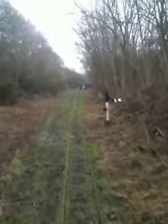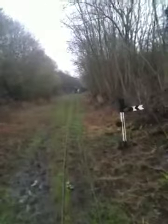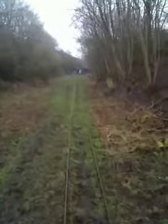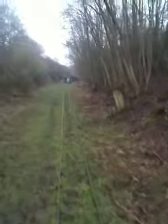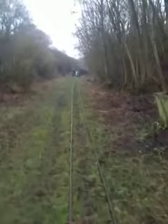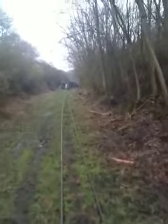Just coming into view now — I don't know if you're able to see it on here because it's a mobile phone video. We've got the signal box. It's got a Westinghouse L35 power frame in it which is being refurbished at the moment, so it's out of operation. But that powers the entire top two thirds of the site and all the signalling and the point work. The points are mainly electric hydraulic with a few electric wind-out motors here and there.